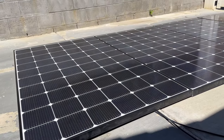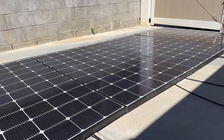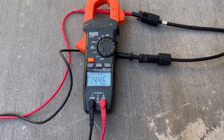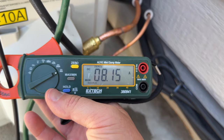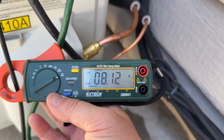When using the solar panels on the ground, this is about 1,200 watts. I'll leave some links below for cheap solar panel options. These four solar panels are giving me right around 144 volts open circuit, and now that it's plugged into the mini split, the solar panels are giving about 8 amps, which is just fine for this unit to run on solar alone.